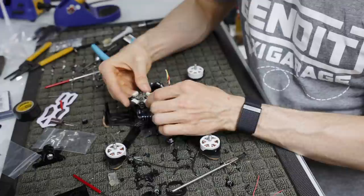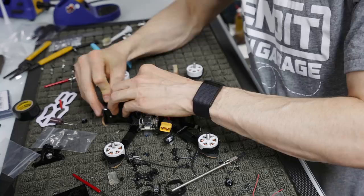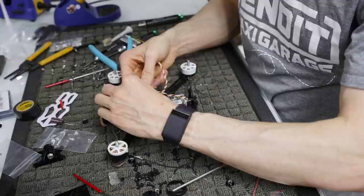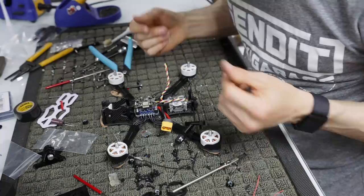That works. So we're going to run our video camera underneath the FC. Going to loosely place this up here. I did check, and it wants the cable on the bottom of the camera, that's up on the camera for some odd reason. Now we're going to tuck this stuff in here. Set this guy here. We also want to solder on a capacitor, so I'll do that now so that we have the room to do it.